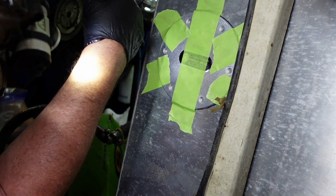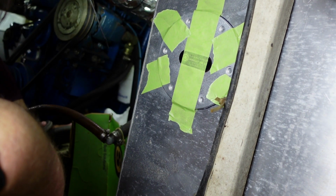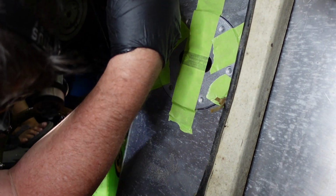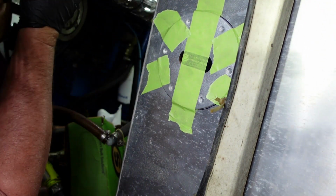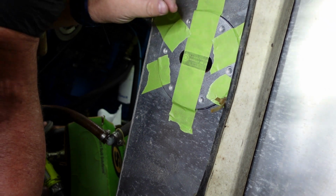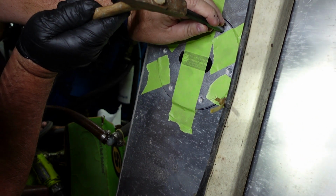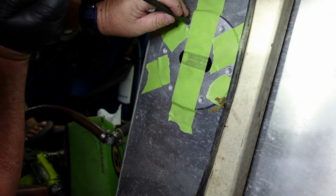Okay, where's my bag? These are all different diameter sizes, so that when I stick this in this hole, it is centered. And then I just tap it all the way around with my hammer. It's just like a guide for you to... It is, I'm making this a guide, yes, because I want my holes to be centered. Otherwise, you mark it with a marker, or you get a center punch and you get it about where you think, and you can get it pretty accurate that way. But I want this to have the highest possibility of succeeding. Perfect. This is soft aluminum, so.